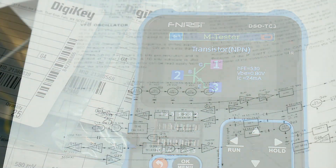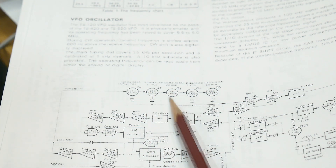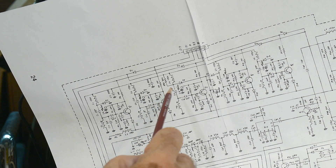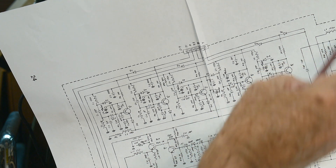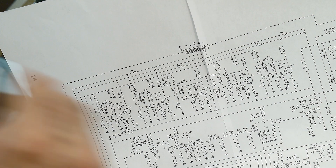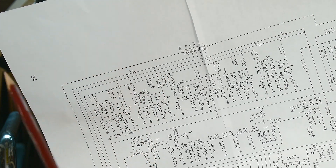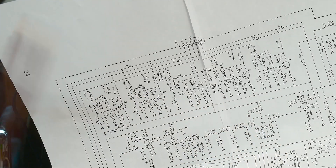I think I was an idiot. Remember I showed you this block diagram - all of the frequencies are diode-switched in. On my schematic there are diodes on top which confused me, but the diodes on the bottom is where the frequency comes out the bottom. Then it makes its way over to the driver and filter to clean it up and comes out as the VCO. I was probing test point TP1, which is a DC voltage into these switchers. TP1 is not the right place to look - we should be looking at the bottom of all these diodes.